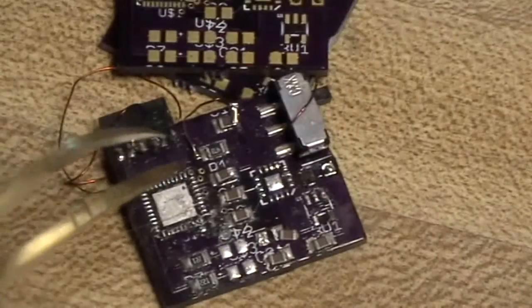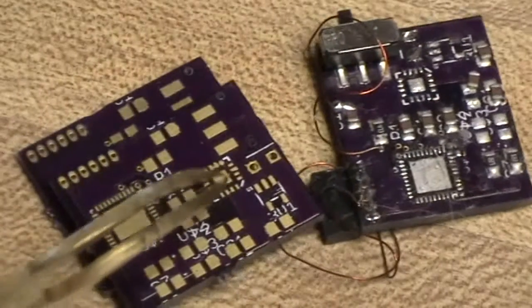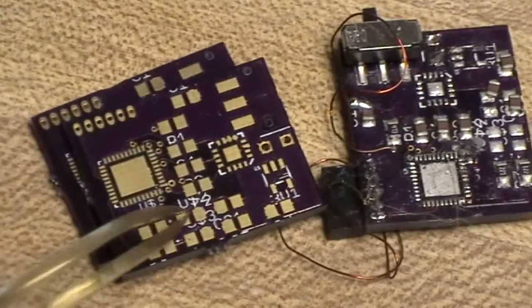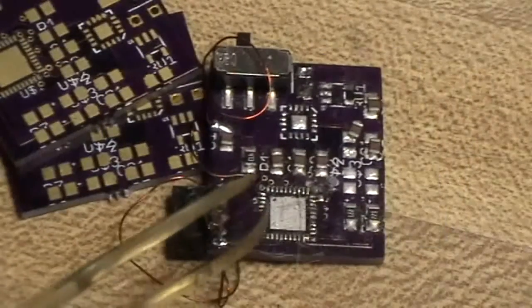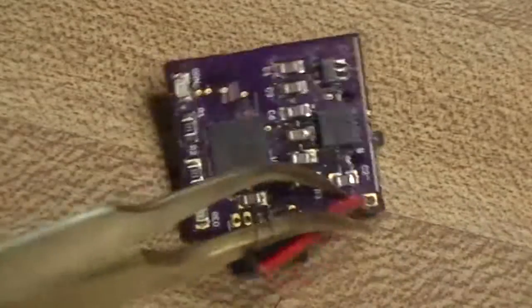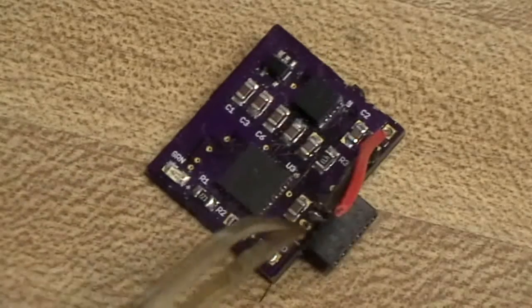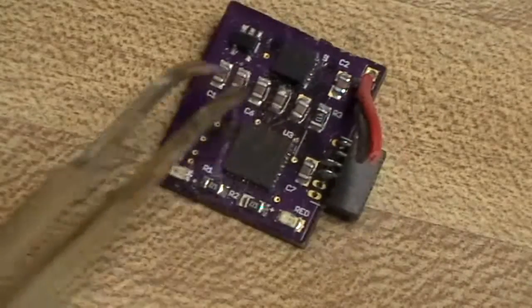Here's getting pretty close to the final design. This just has an accelerometer pad and a CPU pad here, and two LEDs. I've had trouble with the Spy-Bi-Wire programming interface, and that was one issue with this one. I know that capacitor had to go, or else the Spy-Bi-Wire interface wouldn't connect.